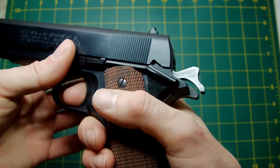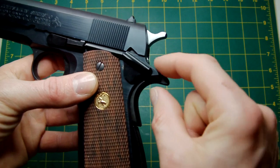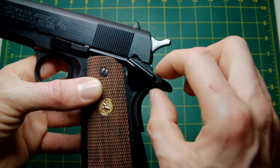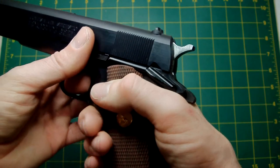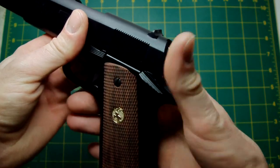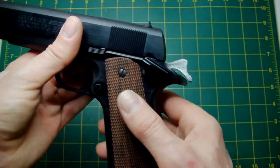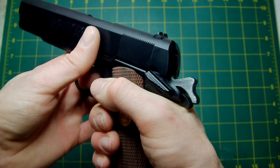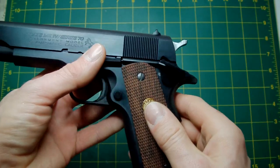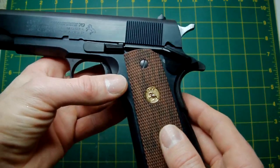You've got the half-cock position as well as the full cock. The grip safety is different — it's arched more downwards than on earlier models. The reason is Colt wanted to ensure the tang of your thumb and forefinger never got pinched when the hammer came down, so they made it longer and angled down to force your hand further down the grip, preventing hammer bite. This is exactly as per the real steel.